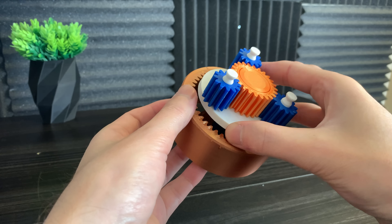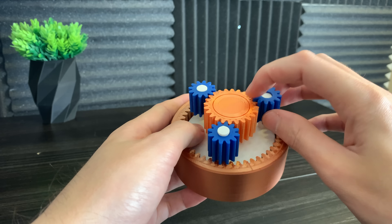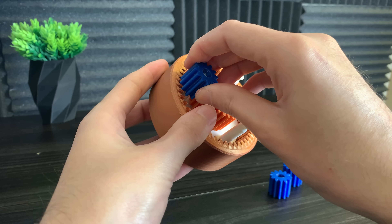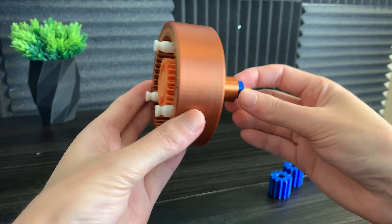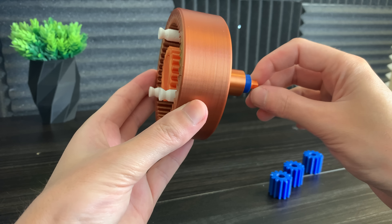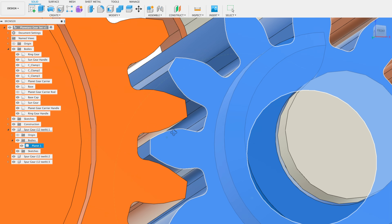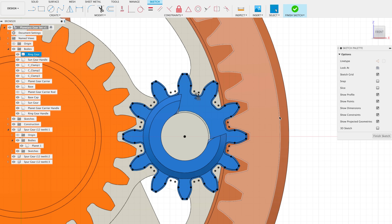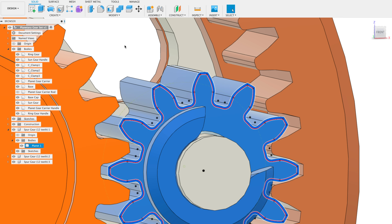When designing parts for 3D printing, it's sometimes difficult to get the tolerances right — the spacing between the different components. I'll have to go back into the CAD program and make the planet gears a little bit smaller. Back in Fusion 360, you can see that I did add some space in my original design between the gears. However, the spacing is not quite big enough. What we can do is offset the outline of the gear and extrude it all the way back — that way the teeth are a little bit smaller.